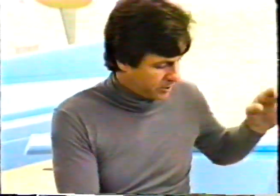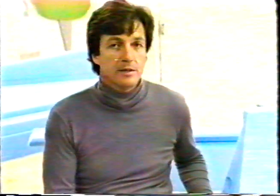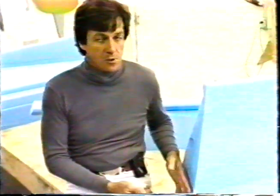Some of this upper surface. I have a pretty close fit here. And on this edge, we have a small hole here, just like the holes down here from screws. We're going to fill that with dry micro when we're doing our laminate process, and we'll show you that when we're actually laminating. This portion of the tape, we're going to show you a process whereby we remove the inboard end of the wing for this inboard.